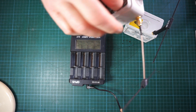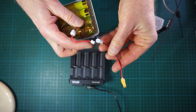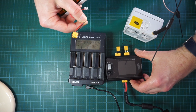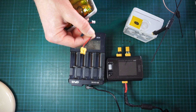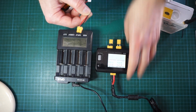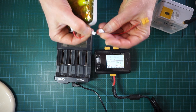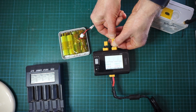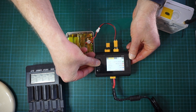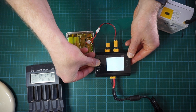Obviously I cannot insert the battery pack into the charger, so one way to do this is to build a little wire harness like this, which converts the JST connector to a connector you can use with a LiPo charger like this one. I'll turn it on to show you. This is booting up — you just connect your little wire harness and insert it into the battery charger.